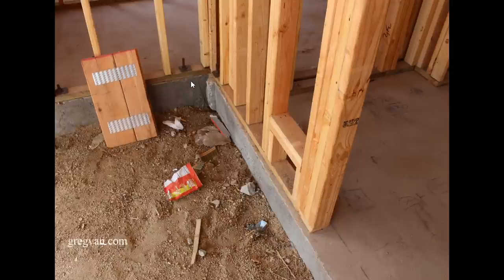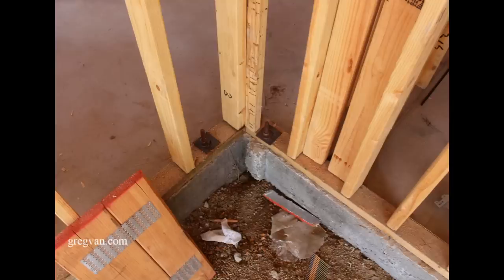If you're going to stucco this house and you put your weep screen on, it's not going to be straight. So again this wall is going to need to be furred out or the concrete is going to need to be chipped. Look at this big protrusion here — I can't even guess what caused that. It really looks like they formed it incorrectly there.